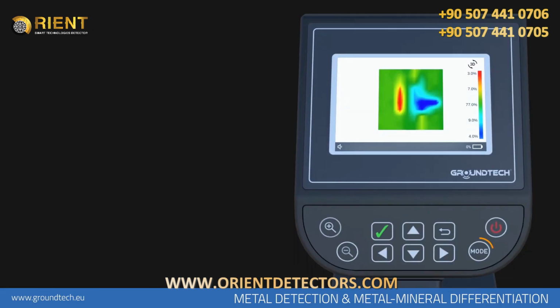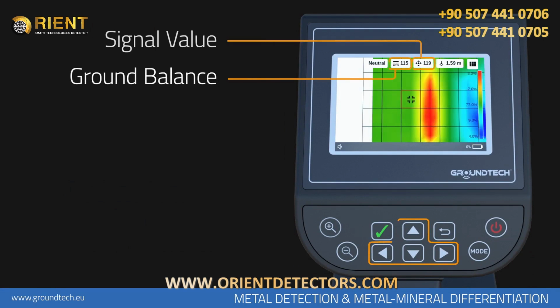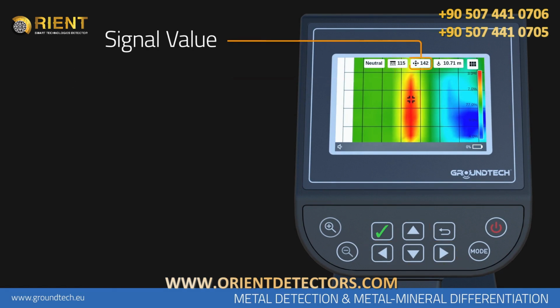In order to see these numerical values, you have to switch to the Scanning Details feature in the 3D Viewer function. You can see soil balance value and numerical values of the selected area in the top bar when you go around the graph with direction buttons. There must be an increase of at least 15 units between the soil, which is shown with green on the graph, and metallic objects which are shown with red.